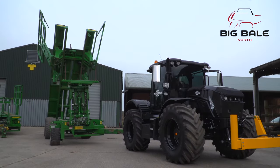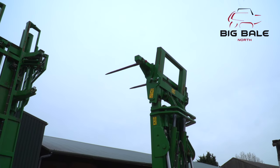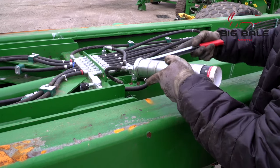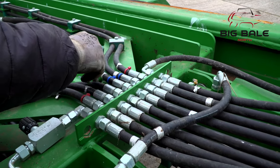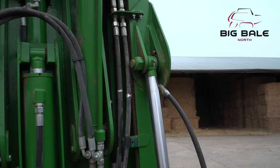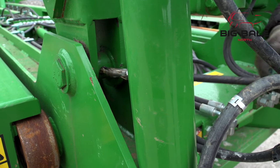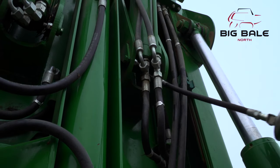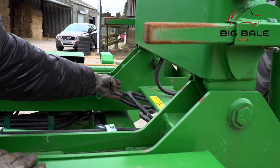The chaser now needs to be tipped up vertically to continue, and you can roll the bale forks to the vertical position to make it easier to reach some grease points. Back on top of the chassis, there are grease points on the rams for the bale push extensions. Also, the carriage extension ram has one at each end. At the front of the carriage are the main headstock lift rams — top and bottom of these. Behind these are the main headstock pivots where it attaches to the carriage. There is then one at the bottom of the bale fork rollover rams. There are no grease points on the MC2 slide extension, and the carriage roller bearings are sealed.